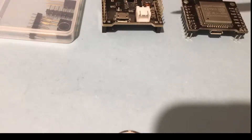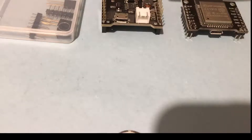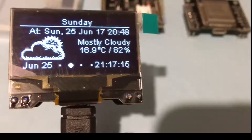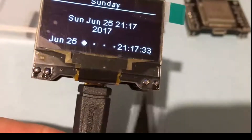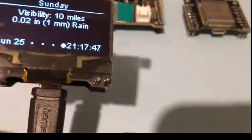I also purchased a battery converter power supply unit, and I also purchased — just to get it in front of the screen — a 1.3 inch OLED. On this board I've soldered in some headers so that I can plug in the display, with plus 5 volt, ground, data and clock, and plug that board in the middle to power the whole unit from a LiPo battery.